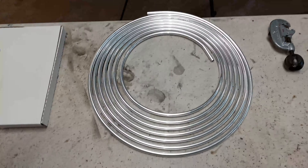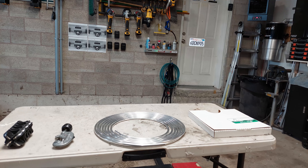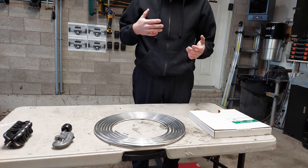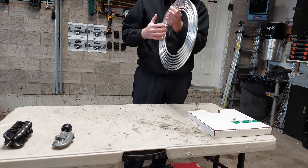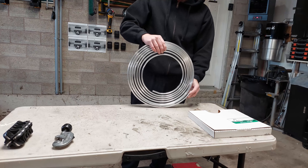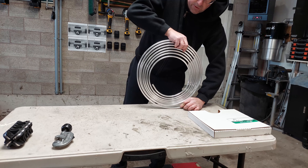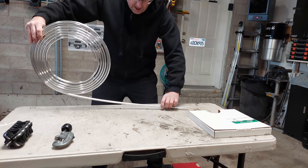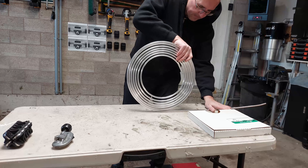Now let's look at how to make this into a straight. This has been covered almost everywhere — if you guys do a search on YouTube regarding bending line and hard lines, I'm sure it's been covered. Essentially, when you take the spool, what you want to do is go against a straight surface. Usually what I do is work on a table. I roll it out, kind of go at the edge — this is a little bit of a trick. I roll it against the table, and as I roll it out I use the surface of the table to get it as straight as possible. It'll never be 100% straight; it'll still be sort of bent. But I open it out against the straight surface in about 4-foot intervals.